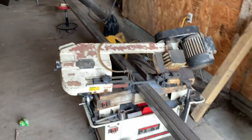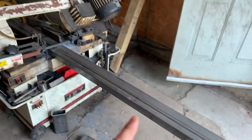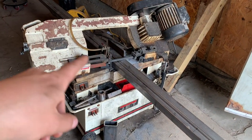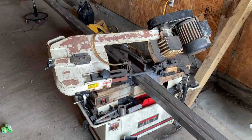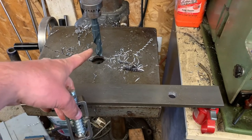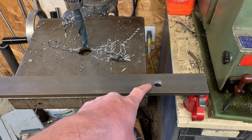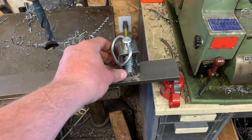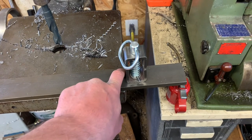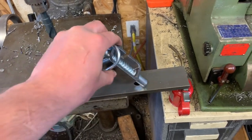These are going to be the long pieces for the sides of the trailer - you can see me cutting them off. I can't remember if these are 20 or 24 inch chunks, but since I've got enough pieces I can cut both at one time so they're exactly the same. This is just an 11/16 Harbor Freight drill bit - these are going to be the side plates for the side gates. This is a five-eighths pin so it's just slightly larger. I'll put it in there, weld them on, then get the gates all built, mark the hole, and weld these on after I drill it.